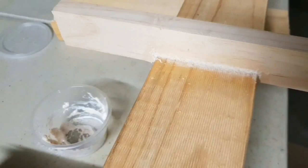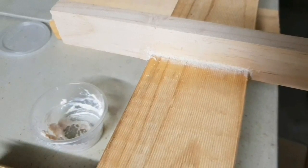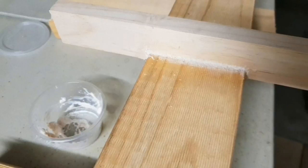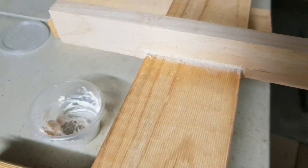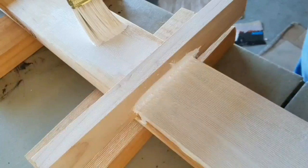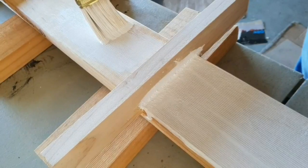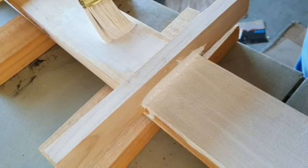Sorry about that, Carl! So now I've combined some of the sawdust with PVA wood glue and put that along all the edges to seal it up a bit and make it look less gappy — if that's even a thing.